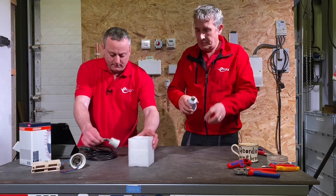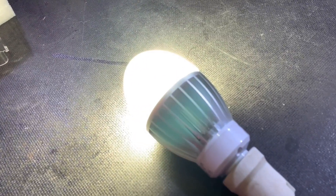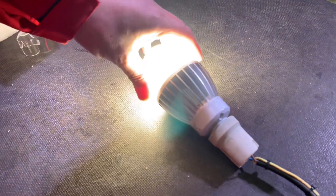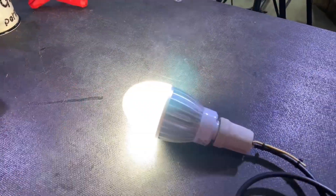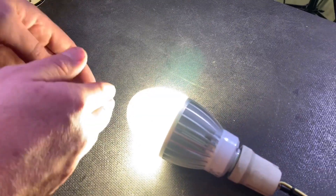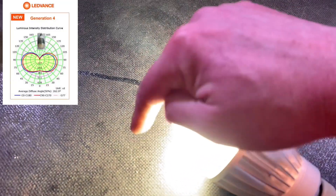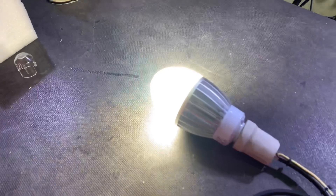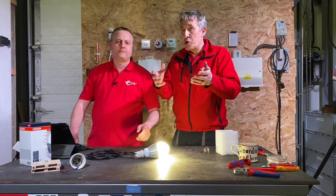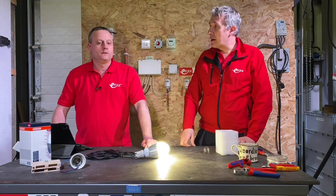With the lamp now live, you can see it's instant light — that's a major advantage over traditional lamps which had a warm-up period. There's 4,000 lumens coming out here. The big difference compared to a corn lamp is that corn lamps emit light in a cylindrical pattern, whereas this Gen 4 product gives a more even distribution with more light going underneath — important for a vertically mounted lamp in an existing fixture with a reflector.